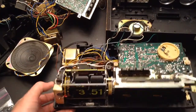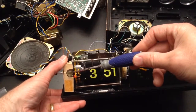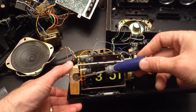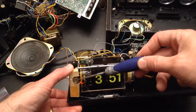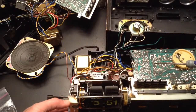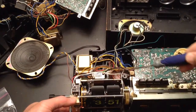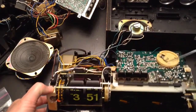Getting the ball bearings back underneath here was a lot harder than I thought. I tried to replace this light with a 12 volt 50 milliamp and it wasn't correct, so I had to take this light off of another clock that was working because this is obviously a 6 volt. I traced the leads back and measured the current — it's actually AC coming off of here to power this, at approximately 6 volts. It is doable to solder it into the board while the board is still in place.